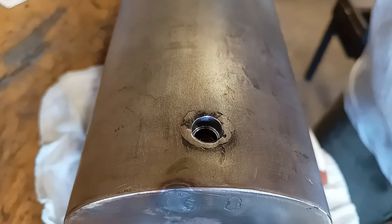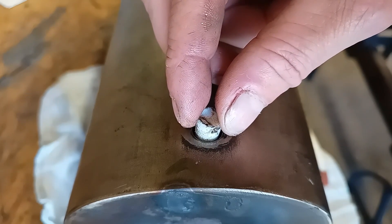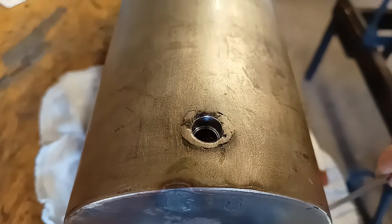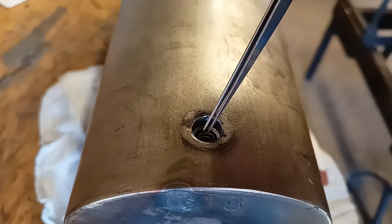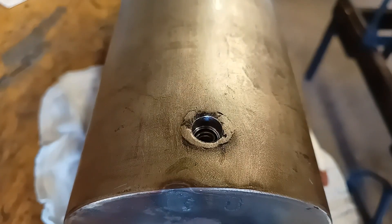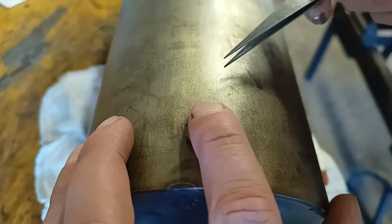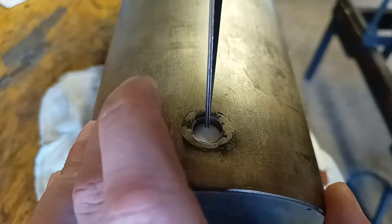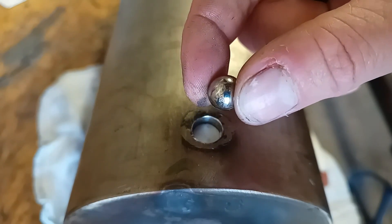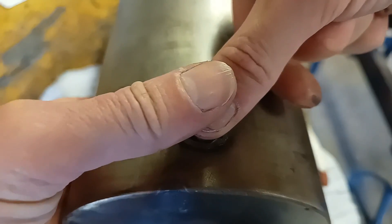I also used PTFE rod in there, which was slightly better, but it did seem to wear quite a bit and then start knocking as well, so we're not going to try that. The new setup — this is an idea from the comments, a very good idea — I've dropped a spring in here, cut to exact length, and I've got a little PTFE disc. I stick that in like so. Now that's pushing against the spring to give a little pad, and then I have a ball bearing — this particular one is just slightly less than 12 millimeters — and that goes in like that.